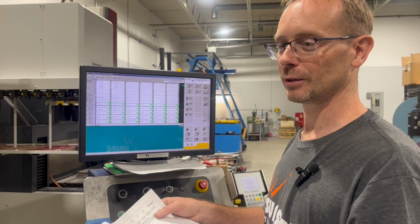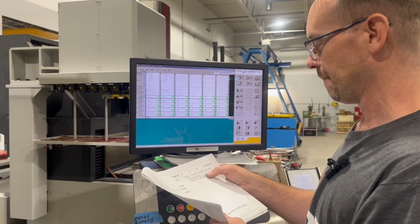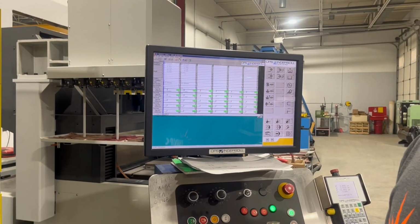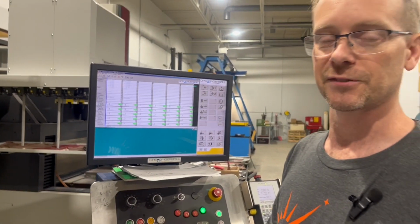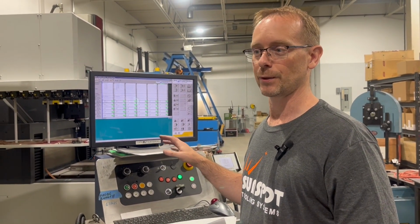Before we start this burn, double check the numbers. Always double check the numbers. Based on what we measured, our electrodes were roughly a thou and a half tall, which is fine. You can deal with that when you're making electrodes. You just compensate for it in the burn depth.